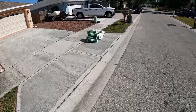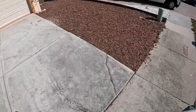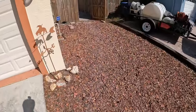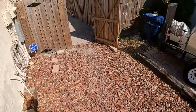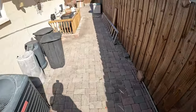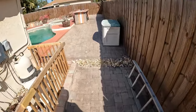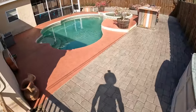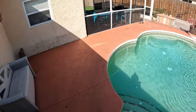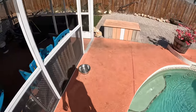We are back and the turf finally showed up and we got our infill bags. So now we are going to cut the turf, put it into the small area, get it glued down, make our final cuts there. And then we have to set those bags on top of the glue until it dries up before we can stretch it and finally staple it down and nail it down.